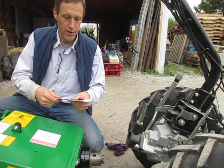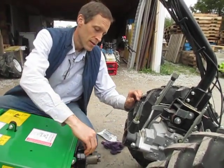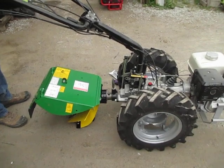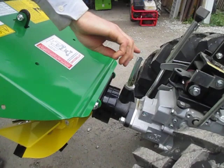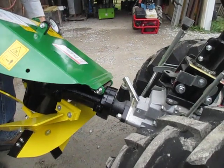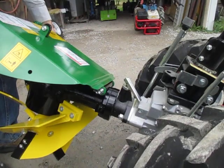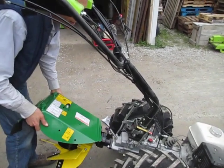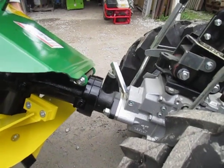I'm going to demonstrate how sensitive it is. It's an old wrapper off of a gasket maker — that's like a cereal box thickness cardboard. Look, it kind of wants to go in but it won't go in. I've probably held that thing off 10 thousandths of an inch, maybe 20 thousandths of an inch — it's not enough. I can't get it in there. Sometimes you can fight and wiggle and you can see it moving that pin around — it wants to go down in that hole but it's not quite there.